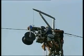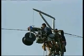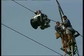Transferring the machine is also quick and easy. The machine continues operating automatically and a spiral-shaped bypass rail is used to guide the cable around the top of the mast and into the next span of wire.